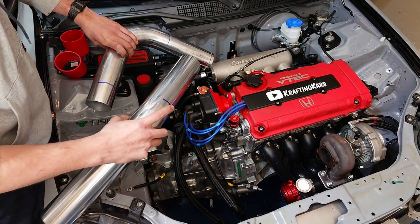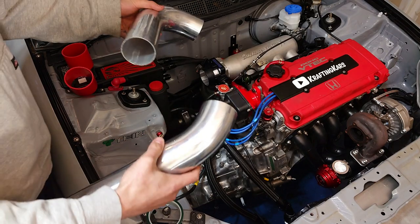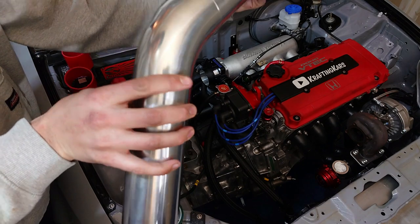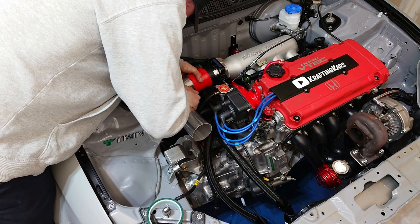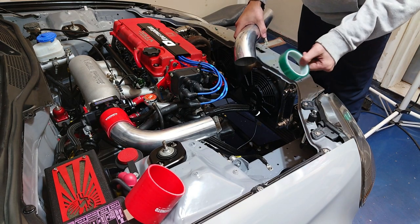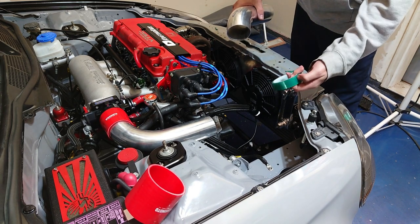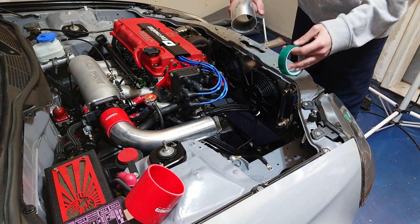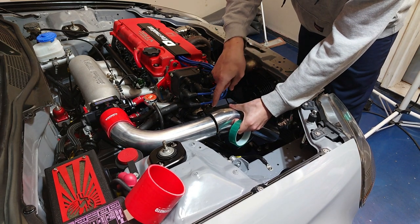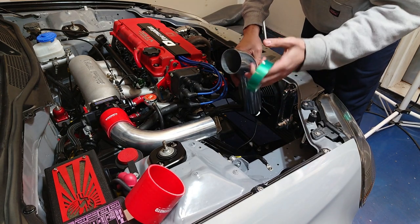Alright, I think I'm ready to go make my first cuts — I'll be right back. Alright, I'm back and those cuts turned out super clean, that's going to be perfect for welding. Let's get it mocked up. Now I'm using a special tape to mock things up today — this is called PET tape. This stuff is really nice because it works well in the cold, it's super heat resistant, and when you go to weld you can cut off little sections and start tack welding without the tape melting or causing any issues.